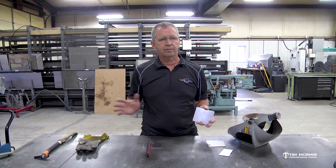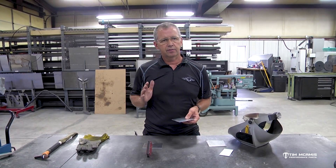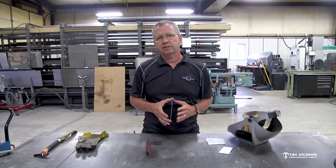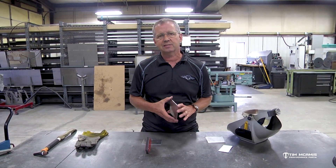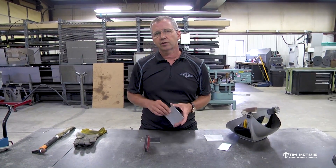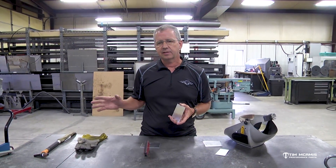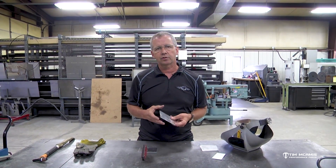Any welder will work - Lincoln welders are good, Miller welders are good - but if you're welding aluminum you're gonna switch to AC instead of DC. We've been on all the other metals using DC mode, and we're gonna switch to AC tonight. If you're using a Dynasty it's already gonna pick up the high frequency mode that you need to weld aluminum.